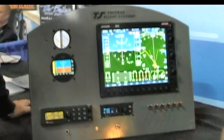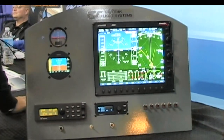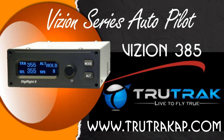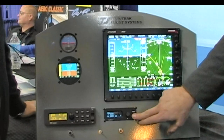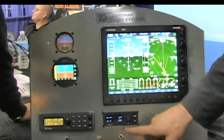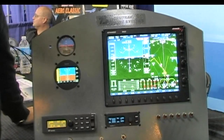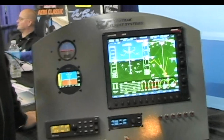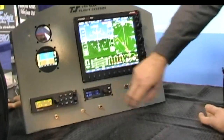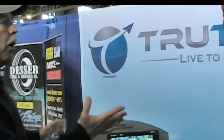That's correct. The Vision here is actually in a Digiflight bezel, because it's the exact same size as the Digiflight was. So it's a drop-in plug-and-play replacement for the Digiflight. The Vision adds some new safety capability — we've got an emergency level button that we've added. Push the button: wings level, zero vertical speed. We've also added a neat feature, altitude select. Push ALT on the autopilot, dial in the altitude you want, enter that number, and then set your vertical speed — your VSI. And now you are climbing to this selected altitude at this vertical speed. The autopilot is going to fly up and level off. You can also go straight to altitude hold pretty easily — just push the button, and now you're in altitude hold wherever you are.